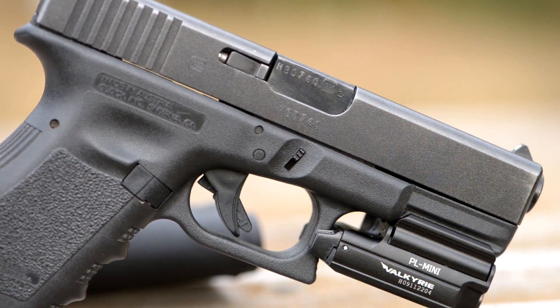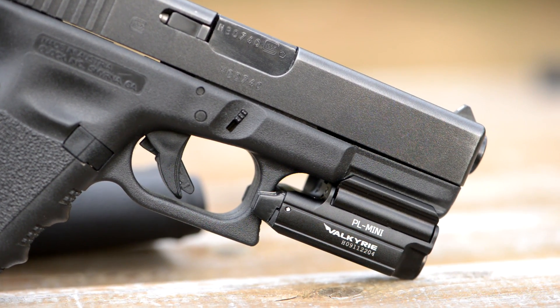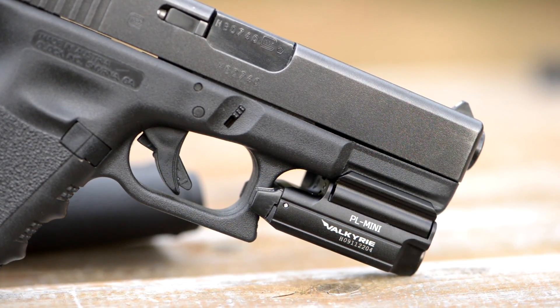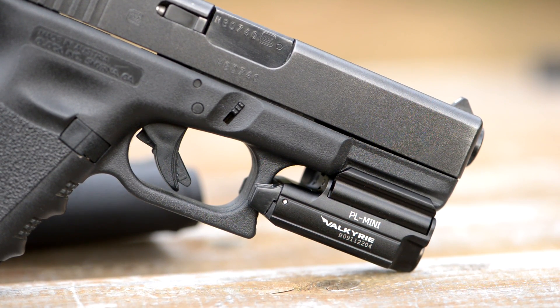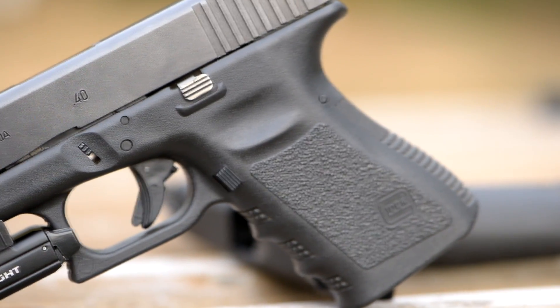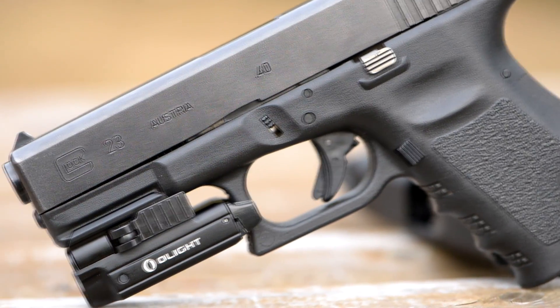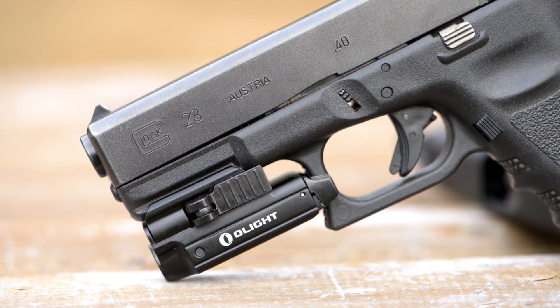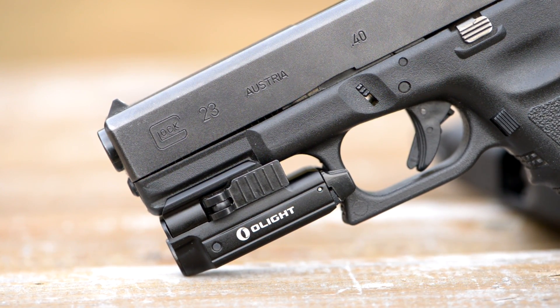It has a 71-minute run time rating from a full charge. Now, you're obviously not going to get 71 minutes at 400 lumens from a light this small. What this thing does is lower the power output gradually over the first 10 minutes until it gets down to about 60 lumens, and that's where you'll get the rest of your run time. You can switch the light off and back on to start the cycle all over, but that will cut into your run time.